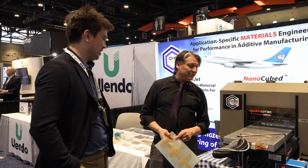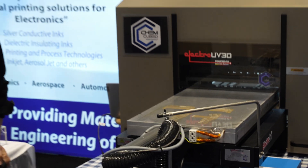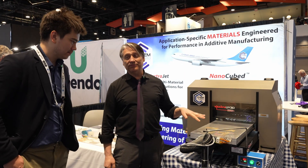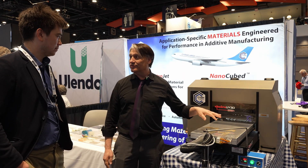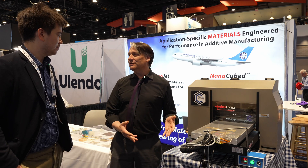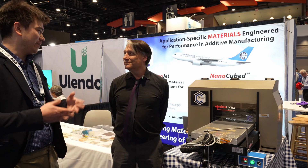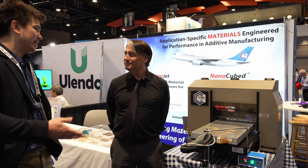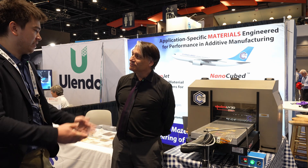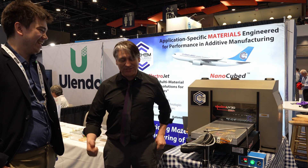It started during the interview and it just finished during the interview. When you print something out you need to wait for the ink to dry — do you have to do the same thing here? The silver takes about four to five minutes to finish sintering on the board. There's some time between layer-to-layer stacking. Traditional particle inks that might be trying to do this have up to an hour of post-sintering. When I get a PCB design and want it made, it usually takes several days because I have to farm that out to somebody else. But with this, you can just have one small machine that's able to produce pretty much finished products.